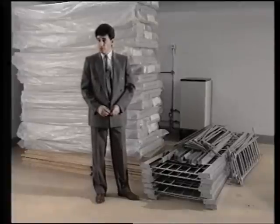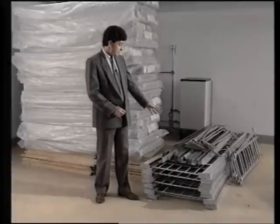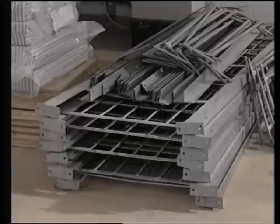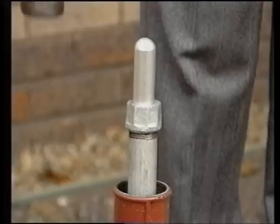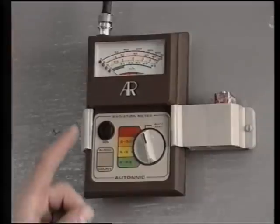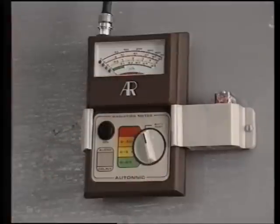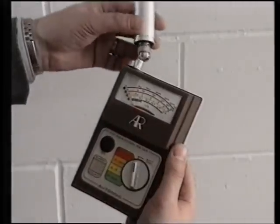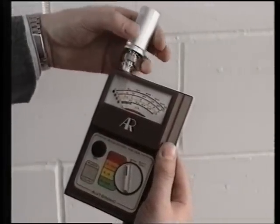Because of the centre's dual role, the dormitory is not a permanent feature. The bunk beds here can be erected quickly should the need arise. An RD81 radiation meter should be sited within the protected area, with an external probe facility situated outside. It enables people to read the level of radiation outside before anyone leaves the protected area. This particular meter can also be used as a hand-held instrument, making it very cost-effective.